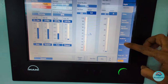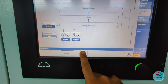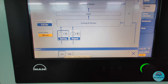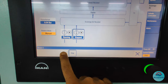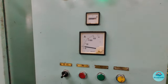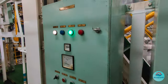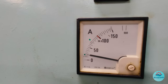Now it's time to test the functioning of the contactors. So power on the breakers on the local and the main feeder panel. On the MOP screen, change the auxiliary blowers mode from auto to manual. Start both the blowers manually and check the amperage on the ammeter. With engines in stopped condition and no scavenge air consumption, the auxiliary blower motors should draw a minimal amount of current. This indicates the contactors are functioning satisfactorily.